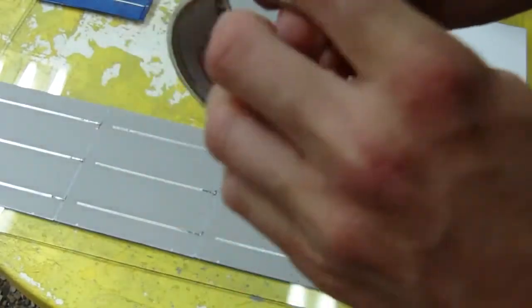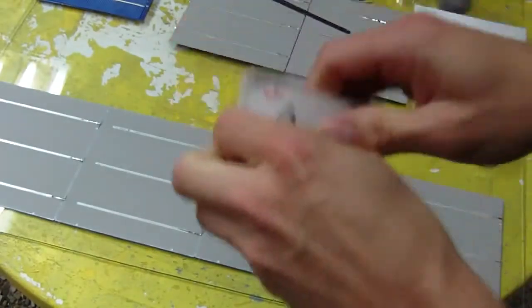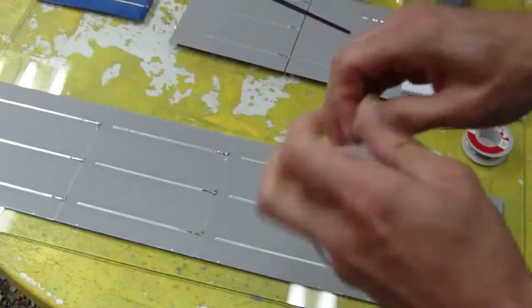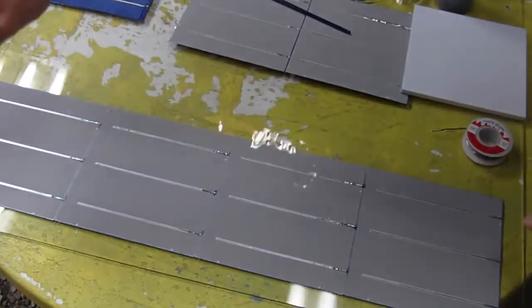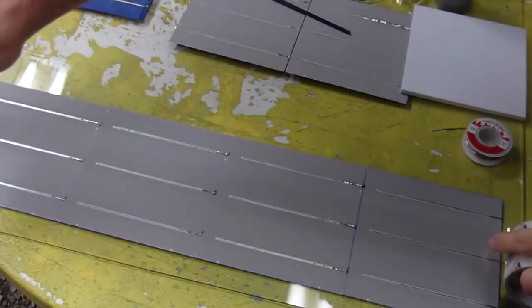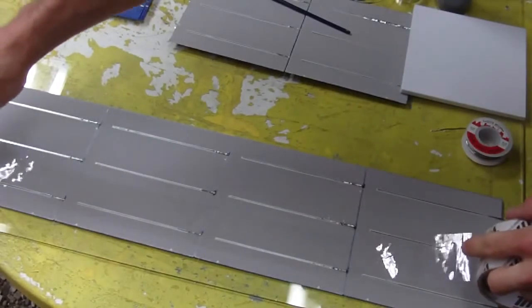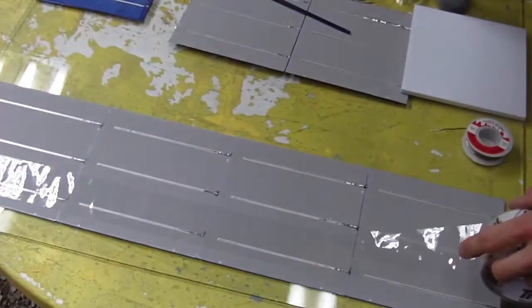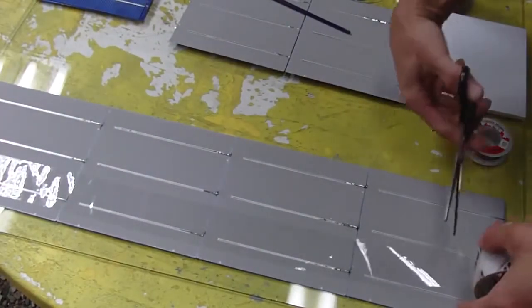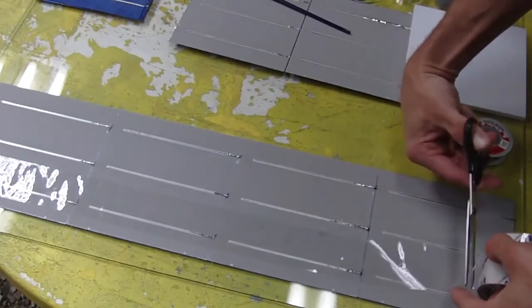You can move them without taping them, but if you let them bend in any way, they'll crack, unfortunately. So what you're going to do is just drop the tape down loosely, no tension, flat down onto the cell. Do not try to change it. If the tape sticks down wrong, just leave it, because if you try to pull it off the cell, it'll crack the cell.